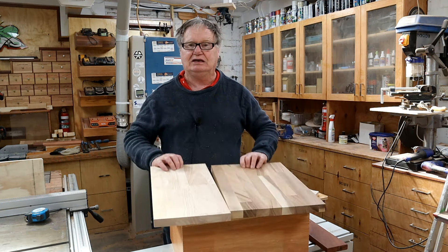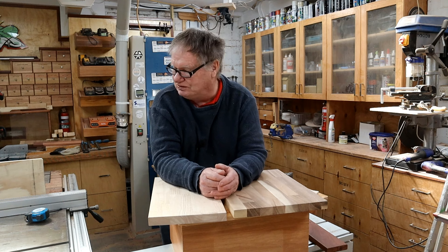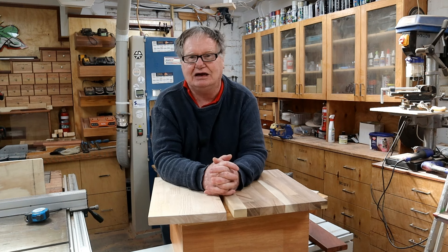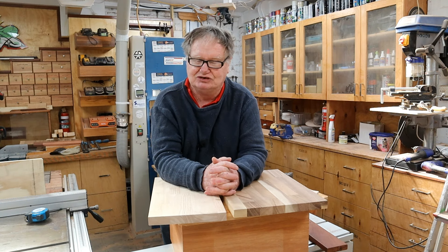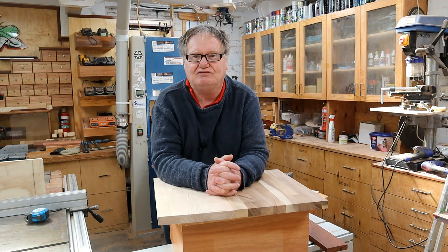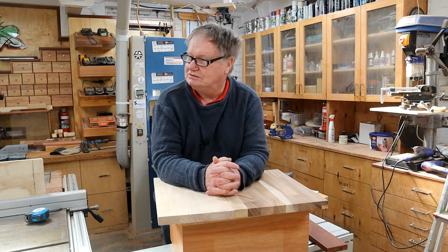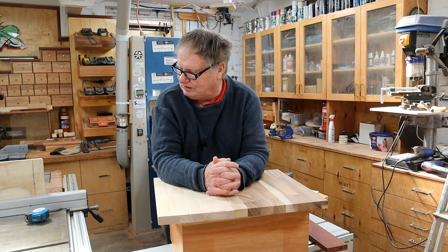I cut the slabs down to 40mm on my small saw. But if you watched the last video, you would have noticed how I bragged about getting a blade from Amazon real cheap for my table saw - I was going to save $100. Well the blade came - wrong borehole. I've got a 30mm arbor and they sent one from the United States with a 25mm arbor. So I'm waiting for the Black Friday specials now before I order the new blade. In the meantime I put in one of my older blades, which is blunt.